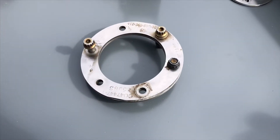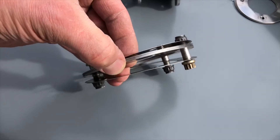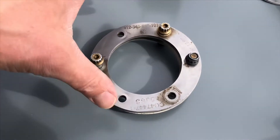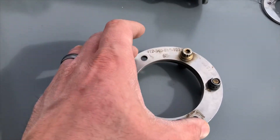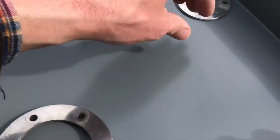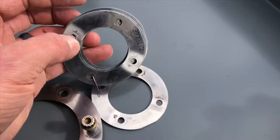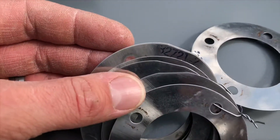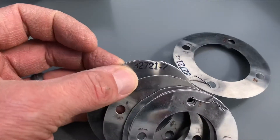As mentioned in class, the Thomas coupling — this is the stack of discs that make the Thomas coupling. One piece of the drive shaft connects here, and the next segment connects 90 degrees apart. The thin metal discs maintain the alignment. When maintaining these, there is a grain direction to the metal and they must be installed the proper way — use the maintenance manual to determine which way they should go.